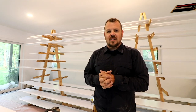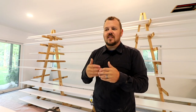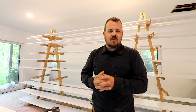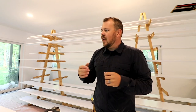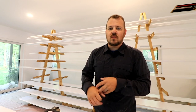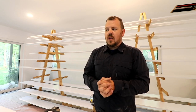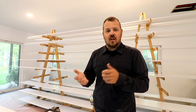That mistake is easy to explain but difficult to understand how it got there. This house was designed by Steve Basic of Steve Basic Architects. We work with Steve a lot and we have R40 walls, R70 insulation in the attic, R9 windows — a really good thermal envelope — and we have concrete floors on the main level.